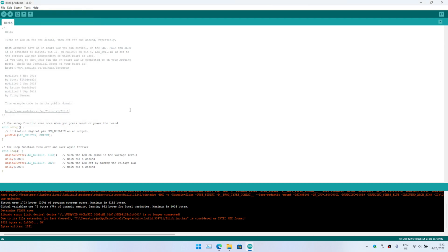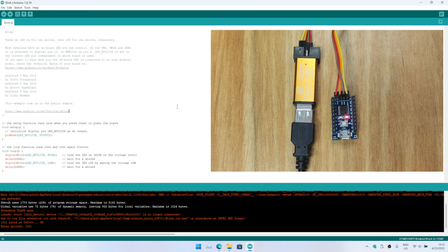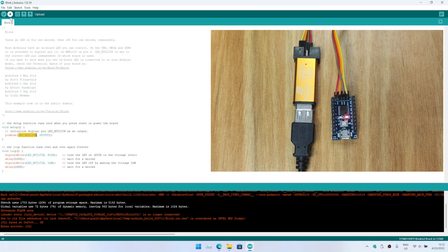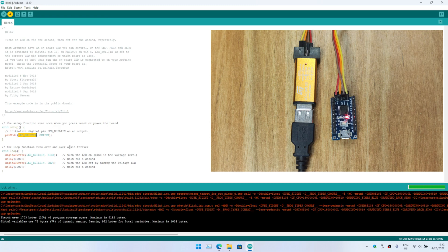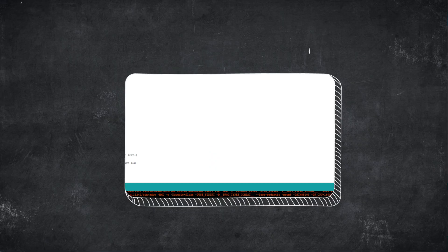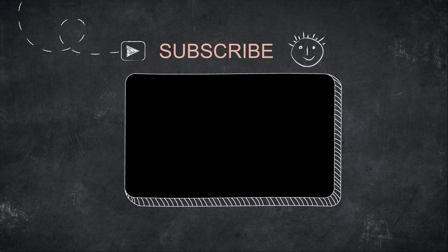I have already interfaced the board using an ST-Link V2 — you can see it's a generic programmer, but you can also use the standard ST-Link debugger. The LED_BUILTIN is already mapped to PB5, so let me go ahead and upload it. You can see that in a couple of seconds the LED is going to blink — and yep, it's as simple as that. If you have any comments, please let me know in the comment section. Please like, share, and subscribe for more videos like this. Thank you for watching — I'll see you next time.